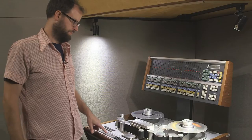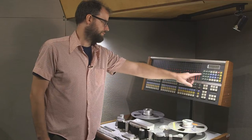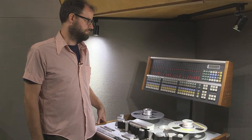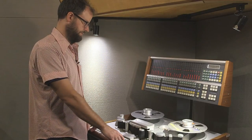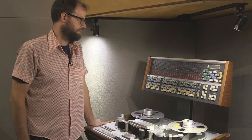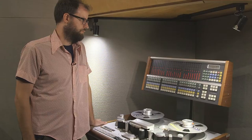If you just hit stop, everything stops and it resets to zero — nothing was achieved. You have to hit store start again to restart the calibration process. And then let's say we're running out of 10k tone and need to rewind and play more — hit locate, then play, and you can see that it picks up where it left off. The repro treble has to be done for both the sync head and the repro head.